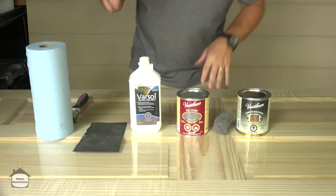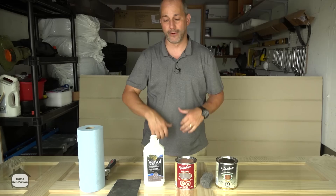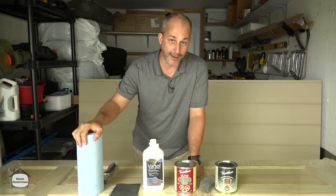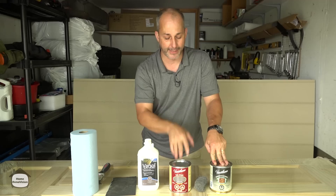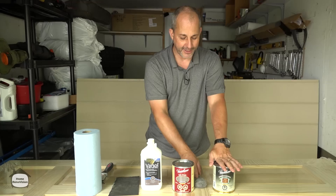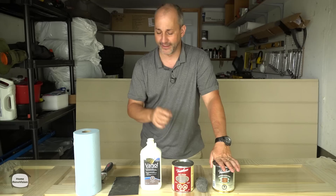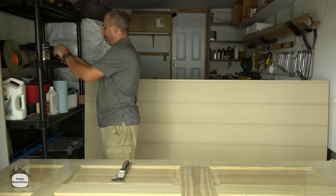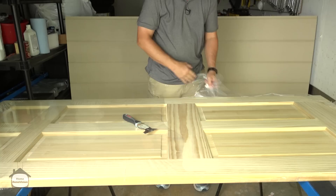Here we are ready to do our door. It's a standard solid wood door, an inch and three-eighths thick, so it can be used interior or replace an existing door. Before you get started, make sure you've got everything you need. I love these little blue towels — I use them to apply and wipe off the stain. You'll need sandpaper to prep the door, some Varsol since these are oil-based products, and 4-0 steel wool used after the finish to get all the little bumps out and make it look perfect. If you have any questions while watching, ask in the comments section below.